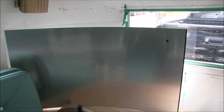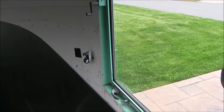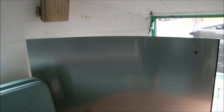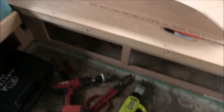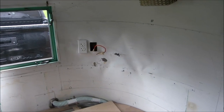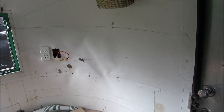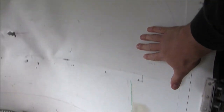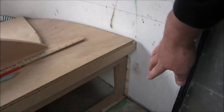Here is a new piece of aluminum. This is the style of aluminum they used back in the 60s and it's got some plastic on it. It's 48 and a half inches long by 28 inches tall — I already had pre-cut it with my electric shears. What I had to do was figure out how much of this material I have to cut out to get rid of that rippling effect. I determined I'm going to replace this panel here, but I'm not going to go all the way down to the floor — it's not necessary.